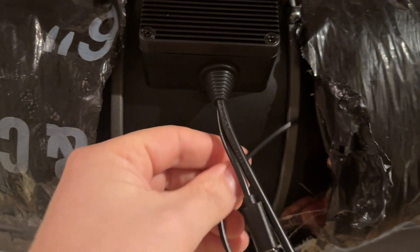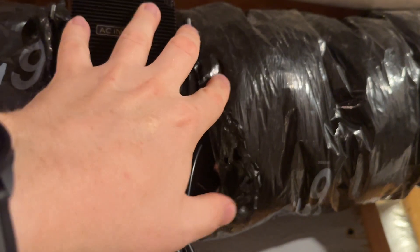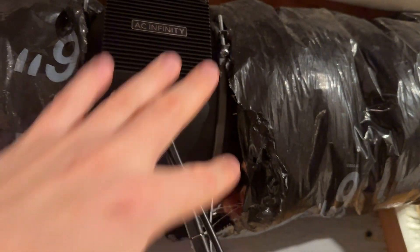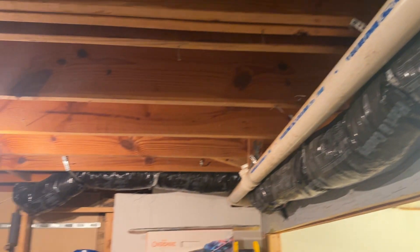This does have a sensor that I put inside the duct, and when the temperature from the AC cools down the duct and the sensor to a threshold that I set on the control panel right here, it will turn on the fan and start pushing that cold air out the vent — as you can see, it'll go all the way over there.